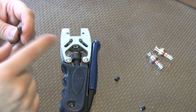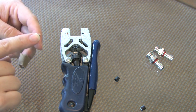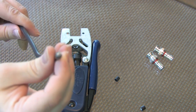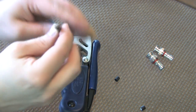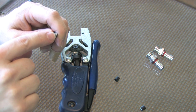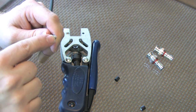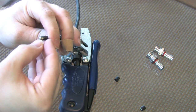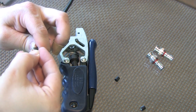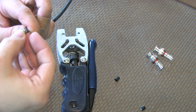It's very important that when we put the connectors on the end, the braid and the foil shield are in no way touching the center conductor. So we'll want to check very carefully and make sure that none of the little pieces of the braid — none of those little silver colored wires running around the outside of the cable — are touching that center conductor at all. You may need to use your fingernail to make sure there's nothing touching that copper conductor that could short it out.